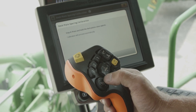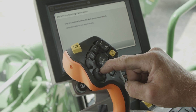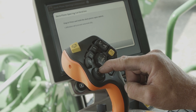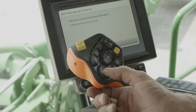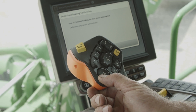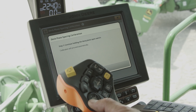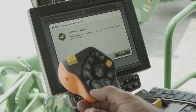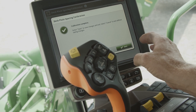Now the calibration will continue automatically. I press and hold our deck plate close button, which is right here. Our deck plates are closing and I keep the button held. When it says open, I'm gonna push the deck plate open button and hold. When it's successful it will come up with a calibration complete page; if it's not successful it'll have an error code.